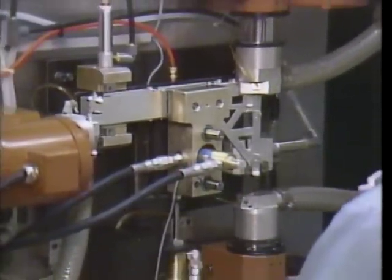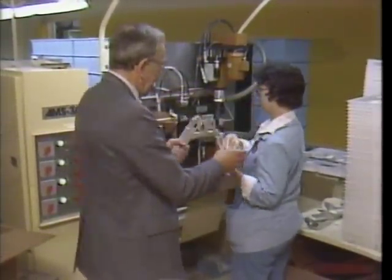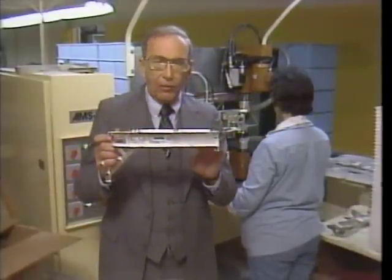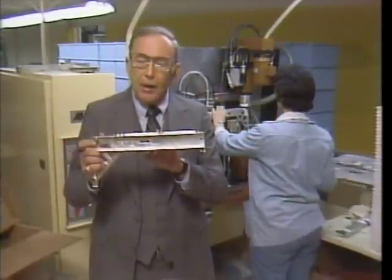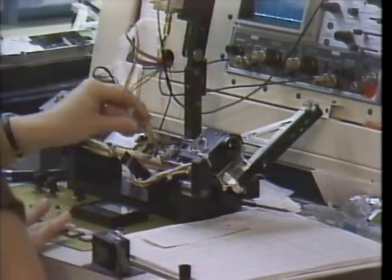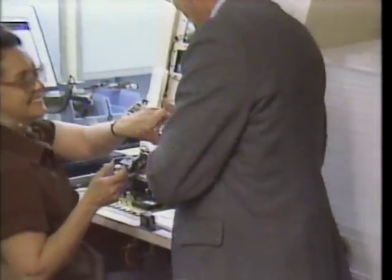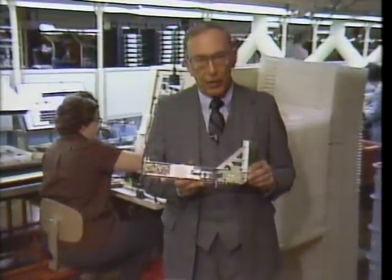We are now beginning tracking arm buildup. Now, the arm assembly is die-cast zinc. This precision boring device is making sure the assembly's fastening holes are exactly aligned. You see, the arm is a very complex device. It must house not only the stylus cartridge, but also the sensitive pickup electronics. When the arm reaches this final testing station, over 80 distinct components on three subsystem circuit boards have been assembled into it. Now this too is ready for final player assembly, along with our master signal processing board.